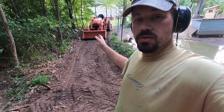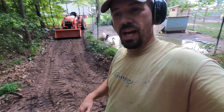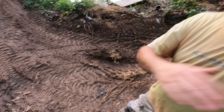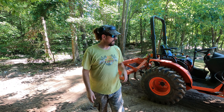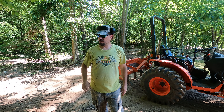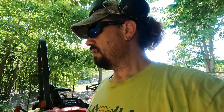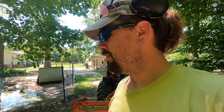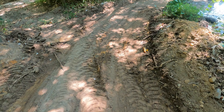This whole area has a lot of clay under it once you get down below the root masses and whatnot. I don't think we'll get to draining the pond because I only got about another hour or so of work. So we're going to just try to level this out a little bit and then scrape some of this material off so that we can get to a good base. The dam is probably going to go right along that tree line. I'm going to try to set it up on the outside edge and bring it back around here and level it out somewhere here.